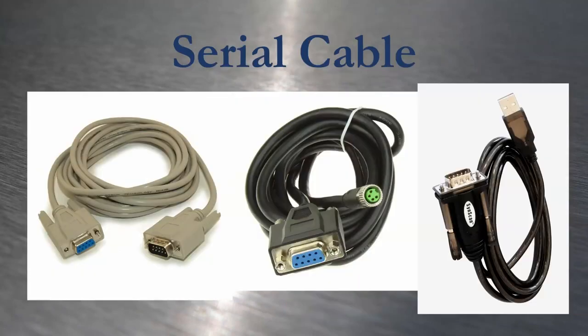Serial cables are used to communicate between a computer and old equipment in the field like PLCs and relays — think USB but in the VHS days. You'll need a USB to serial converter for your modern laptop to connect to a serial port. Serial means only one master and one slave device can talk to each other. If you want to sound like a nerd, the common serial hardware protocol is called RS-232, and they use a DB9 9-pin connector.